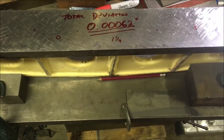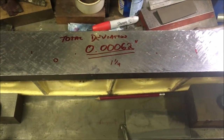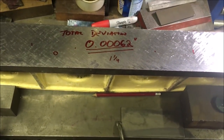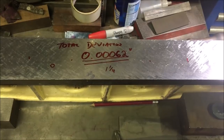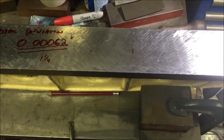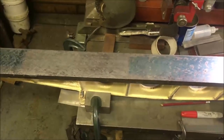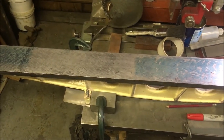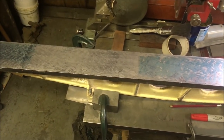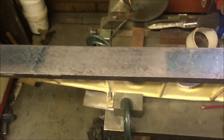I'm taking it slowly because I don't want to mess it up too much. It's a pain trying to print it and then check it with a level, because I don't want to scrape off too much and then end up having to redo the whole thing. So I'm bringing it down a little at a time. I've got it down to a reading of somewhere in the region of plus or minus a quarter of a division, which is, call it 2/10.